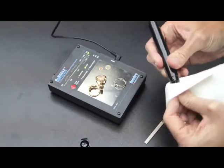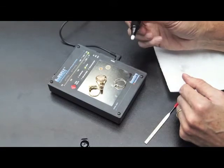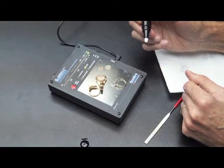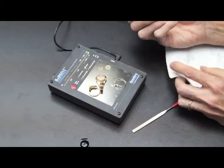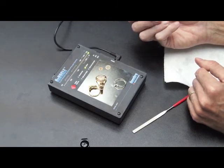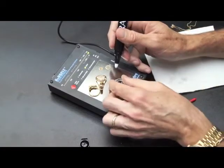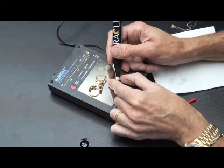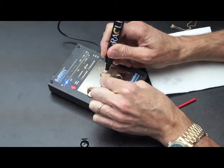Periodically, take the pen probe and wipe the tip with the paper towel again — that's going to remove any gold particles that accumulate on the pen probe over time. The pen probe has a special saline solution in it, and you'll notice that periodically crystals will form on it. That's fine — that's just a natural process of the salt. Wiping it on a paper towel will remedy that. Also, over a period of time, it will start to get darker on the end of the pen probe. Cleaning that with a paper towel is fine. Never use any water or cleaning solutions — just a dry, clean paper towel is all that's required. When you're testing, make sure that you test with the very end of the pen probe. You will potentially get an inaccurate test if you test with the side of it, as it has a tendency to read higher than it actually is. Using the very end, you'll get accurate results every time.